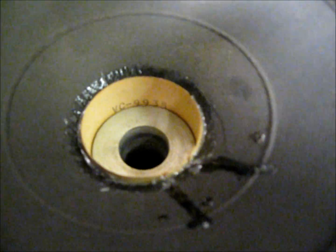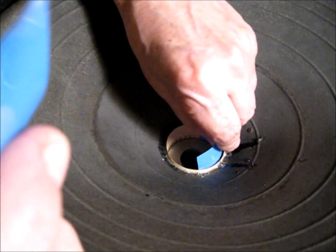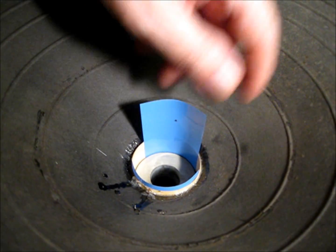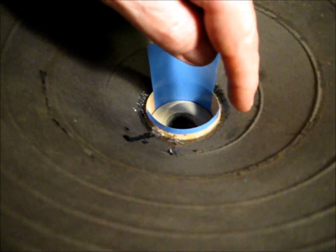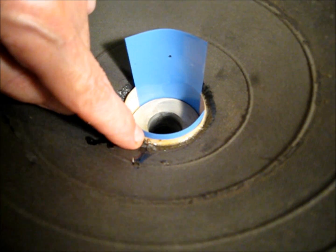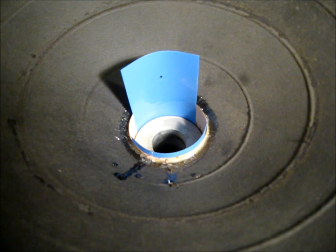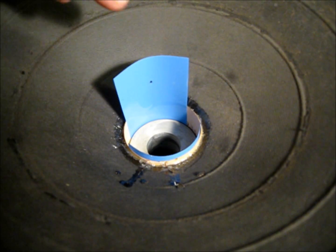So what we did at this point was we used plastic shims to recenter the voice coil. Once we got it recentered, shimmed up, then we went back in here and put a new glue bead down. We also glued down these lead wires too, these voice coil wires, because there's a weak place right there where you could snap that wire. Sooner or later the vibrational modes are going to get in there and cause metal fatigue. So we've capped that over too.